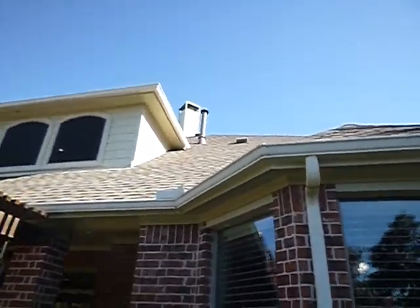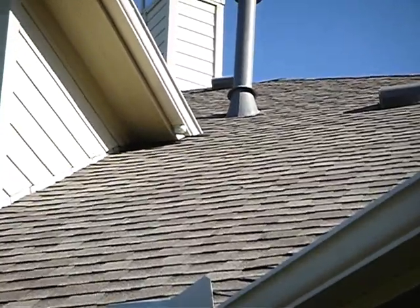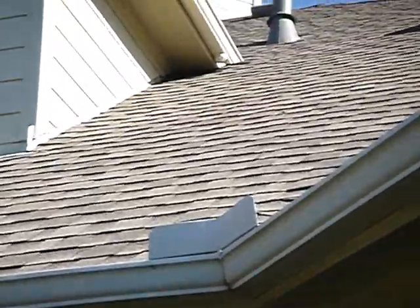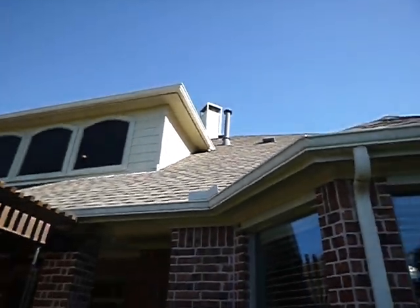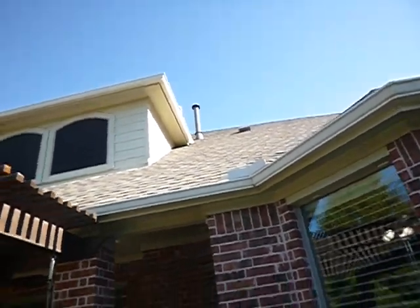And then over here, see the rain gutter? See where it discharges right directly onto the roof covering? Will that cause your shingles to age prematurely? It sure will. Should you have a rain gutter extension coming down here to the rain gutter? You sure should. Is it going to look ugly? It's going to look real ugly. And they only last about 14 years, right? So, I'm here to tell you that it's not right. Sometimes the cure is worse than the ill. Just saying.